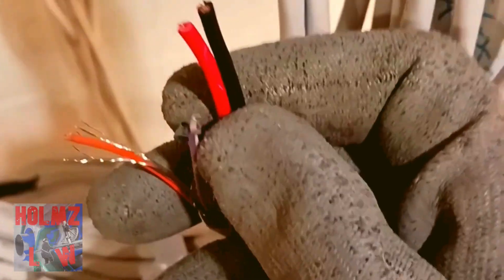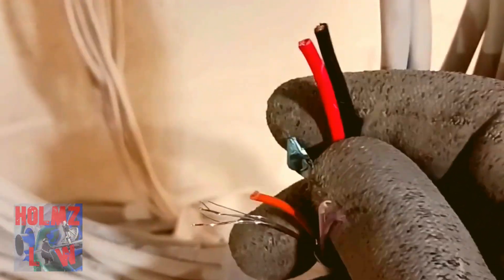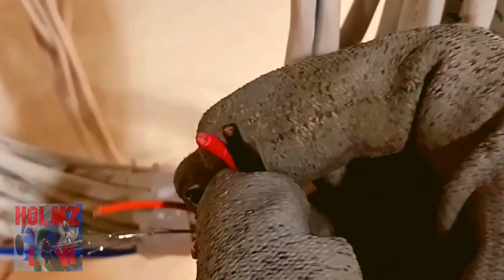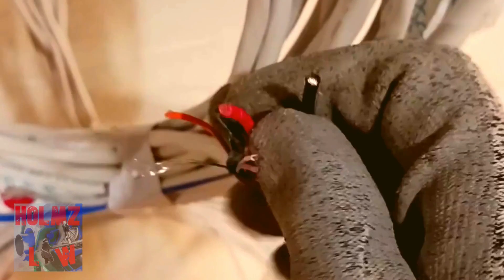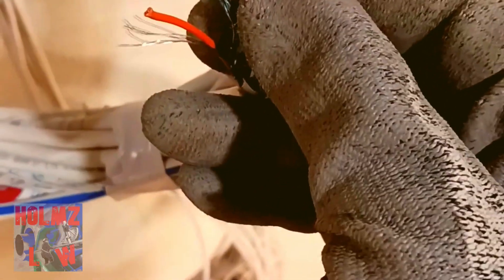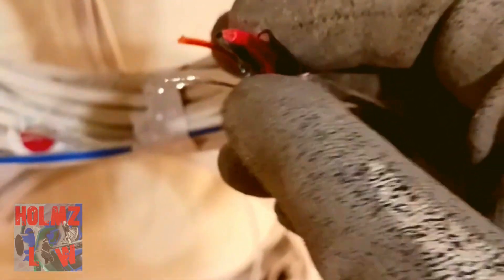This is your 24-volt side. When connecting from panel to panel, you do not hook up the red 24-volt wire. The only ones that get connected are your 22-gauge wires and the common from your 24-volt. The only time you do hook up the red 24-volt is when it's coming from a switch or from the QSM quantum sensor.